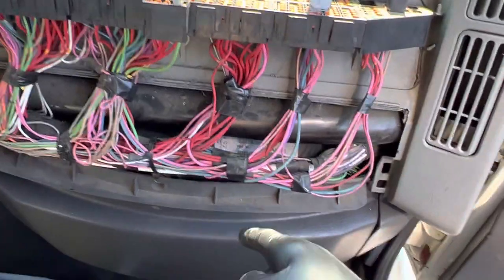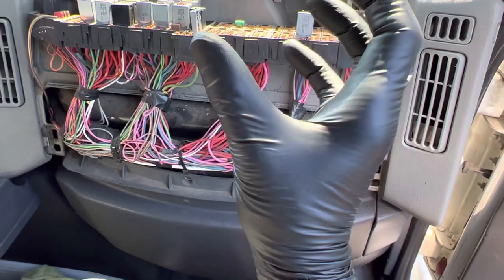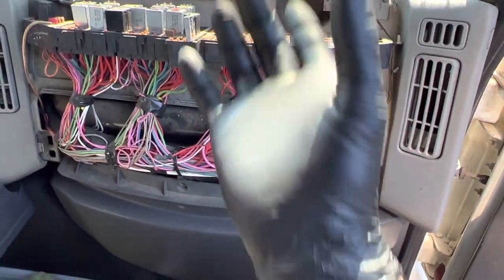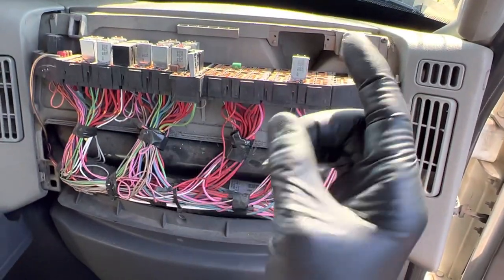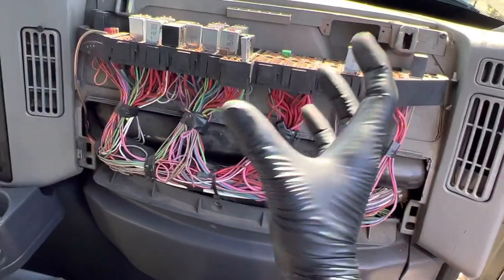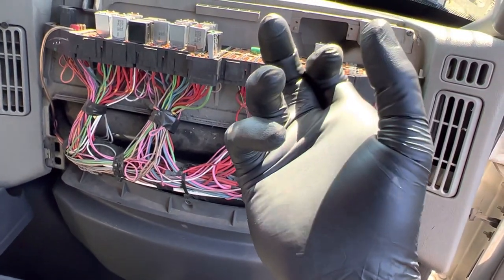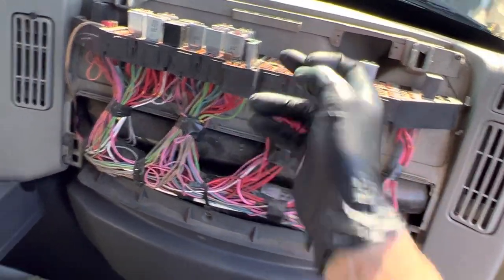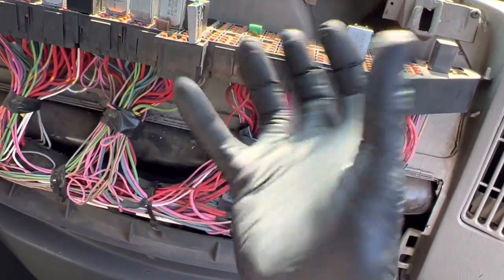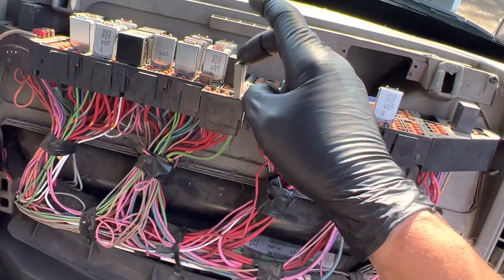Then have him double-check this blower motor. If you go and check and turn it, measure the resistance across each armature section as you turn it — you'll find the section that's shorted out. As it's spinning, there's probably an area where if you try to start it up and the brush is just touching at that one point, it'll hit a dead area and it just won't start. It'll probably just blow the fuse immediately. So it's starting every time when it has rotated into the section where it can start, but when it hits the shorted-out section it'll probably blow this.